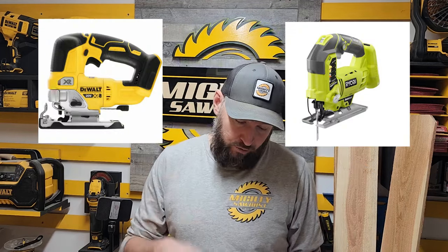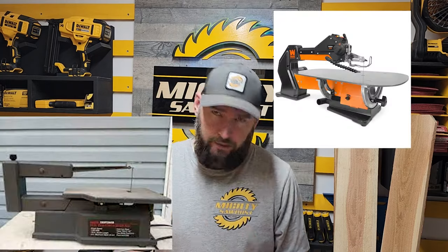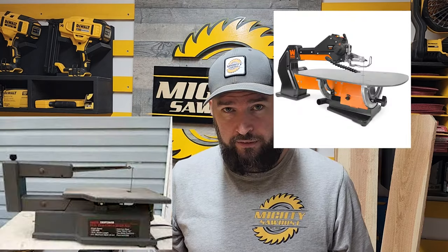The simpler way that most people have at home is a jigsaw. You make the pilot hole big enough for your blade to fit in and then cut out the pieces you need. Another option is a router — some people make a little jig and start routing out the pieces. Or if you have a scroll saw, it's a little bit tedious, but I think that's probably the easiest way because you get those fine curves and better straight edges.